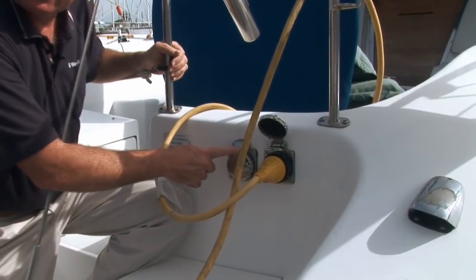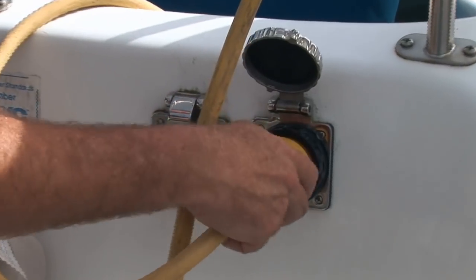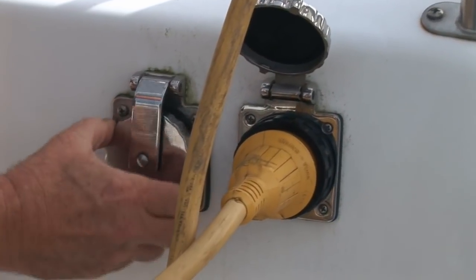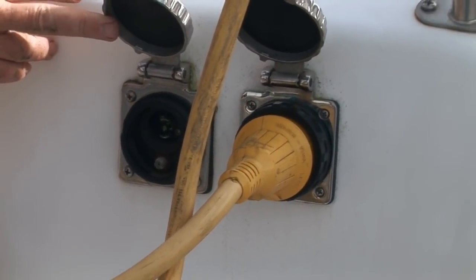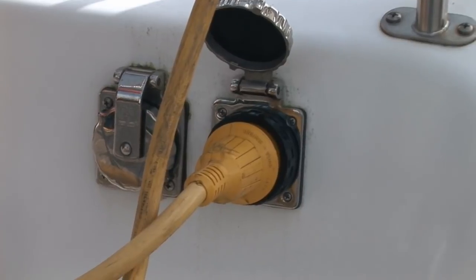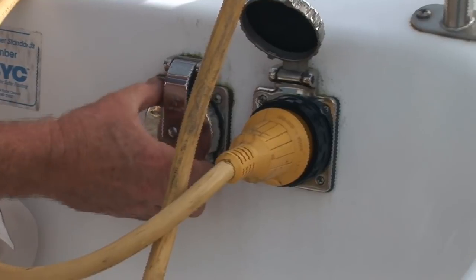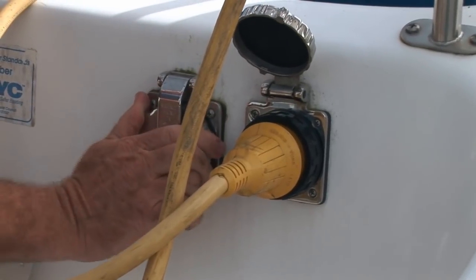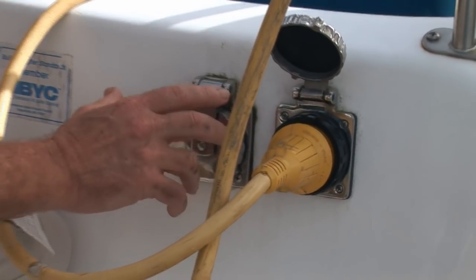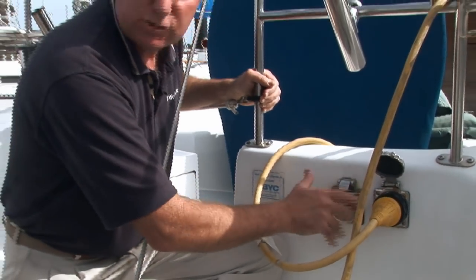On this Catalina 42, they've installed what appears to be a second inlet — here's the normal shore power connector with the sealing ring — but this second one is actually designed for cable TV and telephone, so it serves a completely different purpose. It could have been designed for a second shore power inlet. Incidentally, this uses Marinco's fast-opening arrangement: you turn it about an eighth of a turn and it locks very quickly. It's also compatible with spin-on rings, so if you have an older Marinco cord, you can screw it on.